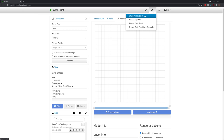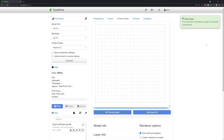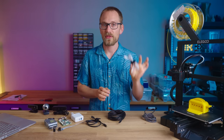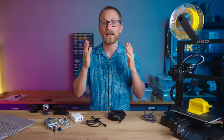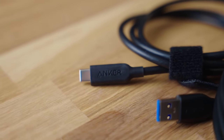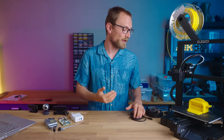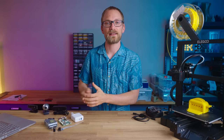Just make sure to shut down the Pi through OctoPrint cleanly before you power off the printer. You will also need a decent USB cable. The Pi 4 uses USB-C, which is great, but many cables from gadgets are too flimsy to provide stable power. I really like the cables from Anker, but a spare USB power delivery charge cable from your laptop should work as well. The Raspberry Pi can detect power supply or cable issues, and OctoPrint will show you those warnings.